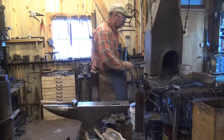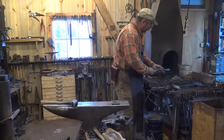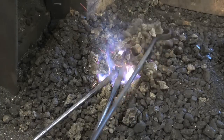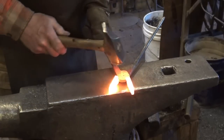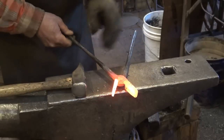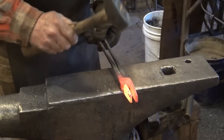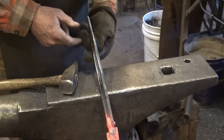So we're going to heat these up in the fire. I'm going to put the rivet head up and the tail end of the rivet that we're going to put the new head on down in the fire. This way we'll be able to heat up just the part of the rivet we need to set. You really only get one chance to get this right, so you need to hold the tongs down tight to the anvil so that the tong reins are together, and then you can set your rivet. If they aren't tight together, you end up upsetting part of that rivet in between the bosses and it's never going to be right. That actually went together pretty well and corrected some of the problem — it looks pretty good now.